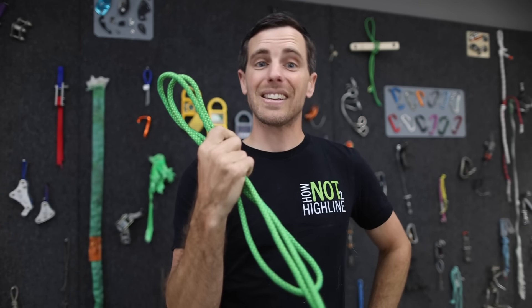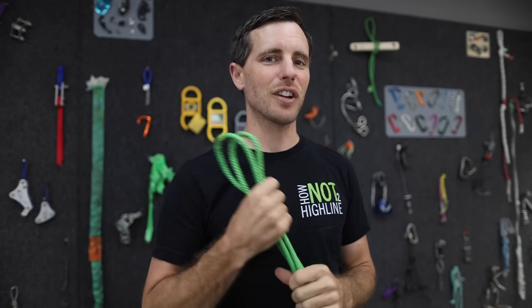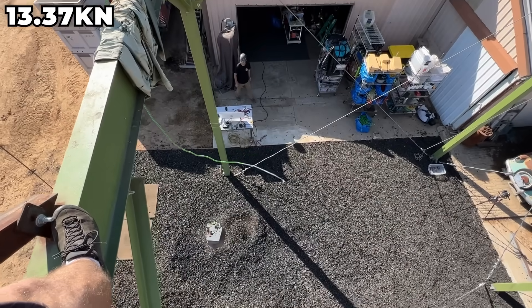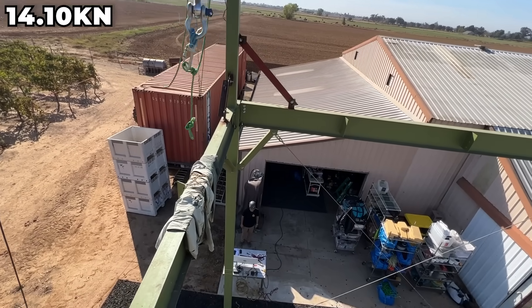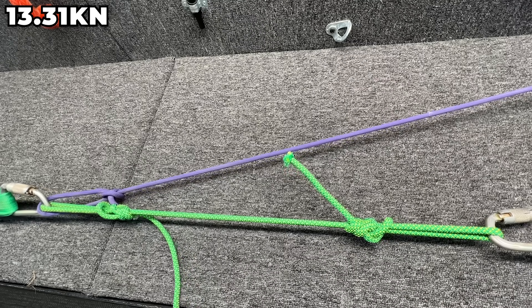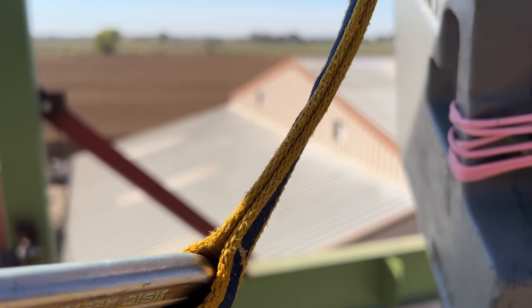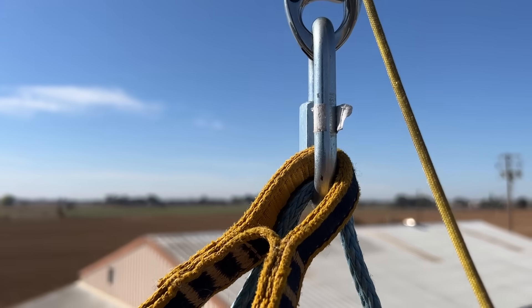Speaking of breaking rope: we tried a very static rope — one of the most static I have, made out of 100% polyester with less than 1% stretch. We dropped it three times and all three times it broke the rope, even with fresh knots. If you're getting 13 kilonewtons on your body you may not even feel yourself hitting the ground — three for three. The slow pull of the super-static rope broke at 13.31 kilonewtons, very typical for that rope, and interesting that these ropes break about the same in the drop tower as in slow pull.